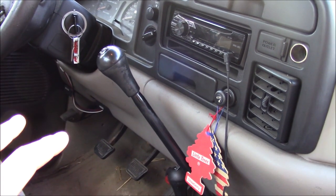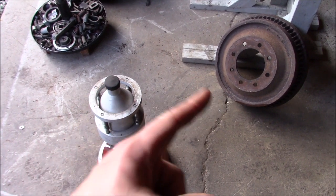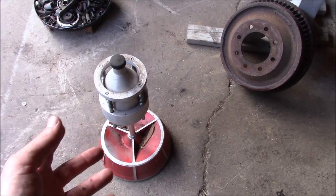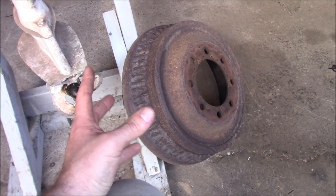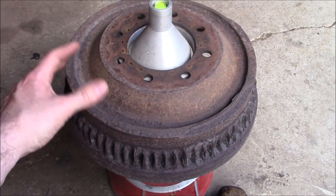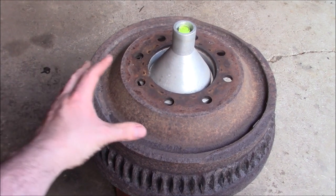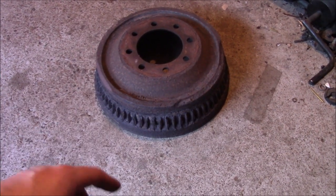We knew this was a serious mechanical problem when it couldn't be drowned out by the radio. The reason I know it's the drums is last year we actually ran those on the old tire bubble balancer, tried to get them a bit closer in balance, and it made a significant difference — the truck shakes almost went away completely. However, after a new winter harvest of rust, things are getting out of balance again. Trying to balance on here isn't quite the most repeatable, since the inside diameter doesn't center well and your weight isn't far out from center, so there's a lot less leverage compared to a tire.